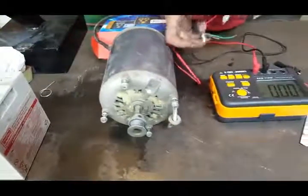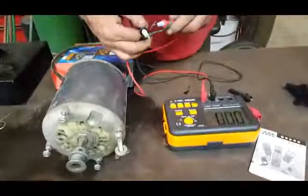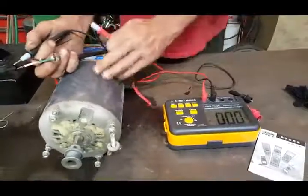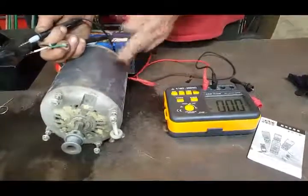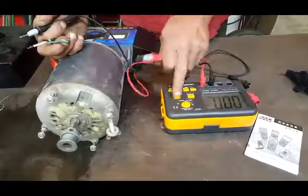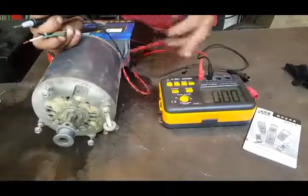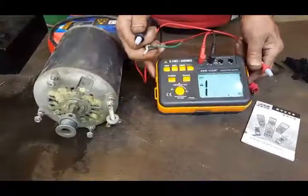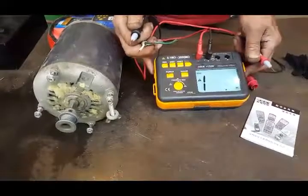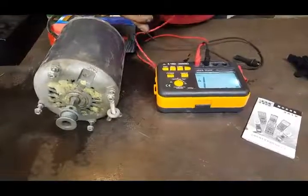Right now I've got a 110 volt motor and because I have no issues with it, it is not going to show anything. If my coils were starting to break down or I had insulation leakage, it would show me some numbers. So let's just power down, power back up, and we're going to pick 250 — there we go. A solid good motor with good windings, that's what you want to see.